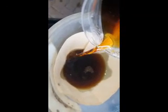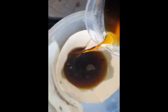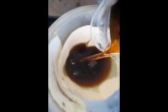And I'll just pour this in. I see all the stuff in there? That's what I'm trying to catch, all that. And as it's going through, I'm looking for any gold flakes to make sure I've got it all. And I can't see any so far. If I see any specks at all, then I'll know that I need some more nitric acid. But I doubt it very much, because there was no more reaction when I was putting more in.